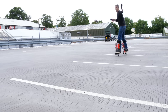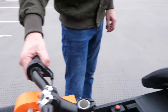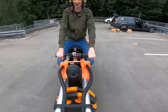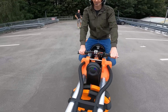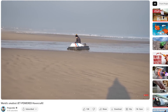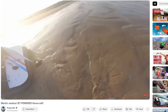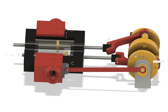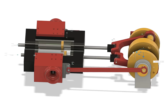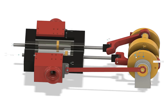I've built a few projects recently where I pushed myself along with electric ducted fans. These run on a 6s LiPo battery and draw 80 amps each, so they're rated at nearly two kilowatts each. That gives quite a lot of airflow and also quite a lot of pressure. Project AIR recently built a hovercraft that would carry a person with just four of these EDFs providing air to inflate the skirt. So this time I'm going to build a two cylinder version of the air engine with each cylinder being driven by an EDF, and we'll see if this is more efficient than just blowing the air against the atmosphere to propel me.